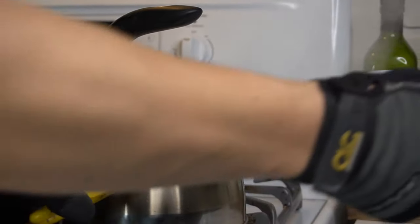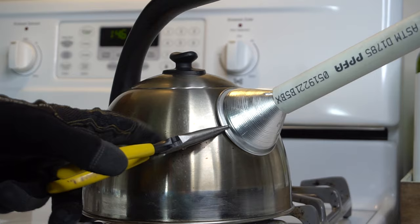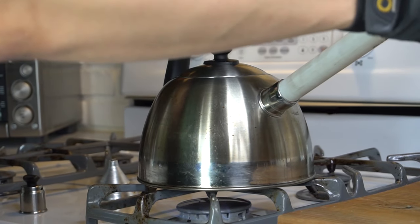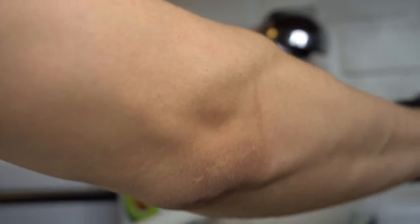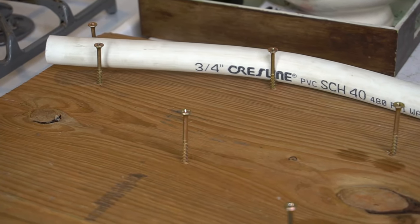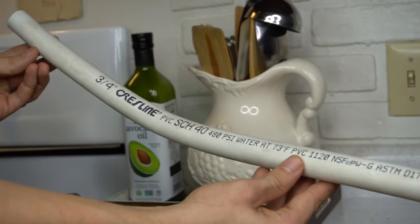If your opening is not large enough on the tea kettle snout, or whatever you're using, you could also use a little funnel to help direct the steam into the pipe. It takes a couple of minutes for the whole pipe to warm up. I found that it works best to have a cap on the other end — not on too tight though. What works best is with the cap on just loosely, that way the steam travels through the pipe and seeps out the other end, warming up the whole pipe. After about two or three minutes to warm up, the pipe cools off really quick with steam — it only took maybe 30 seconds to a minute to cool off and harden. Here's the finished result: a beautiful slight bend, just an offset pipe, looking very good. I call this one 'Snake Junior.'